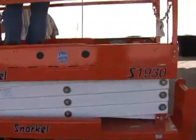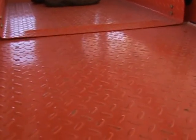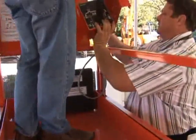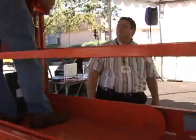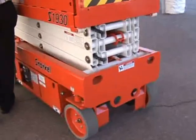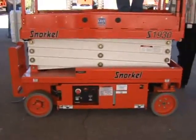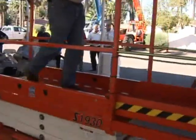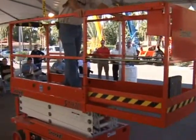The deck is a 36-inch slide-out deck, hitch-pinned at a couple of different locations. The deck surface is diamond embossed for a non-slip surface. It is form-fitted for rigidity. Although simple in design, it's very functional. Like everyone else, we use different size rollers—two rollers inside and small rollers on the outside. Debris is not really a major issue with us; there are quite tight tolerances around the metal frame that it slides in.